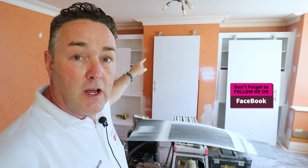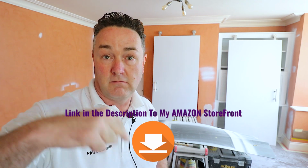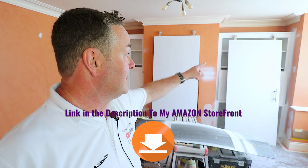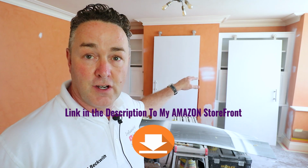Now once all that's dry, I'm going to be planning on denibbing all of these cabinets. They're nice. The edges that had gone round with the Blockade are all seeming to be solid. A nice fine Gold Flex pad, link in the description, and they will be denibbed down today and dusted off, ready for tomorrow, where I will be getting on with the actual eggshell spraying of all the woodwork. So far so good.